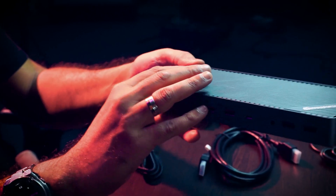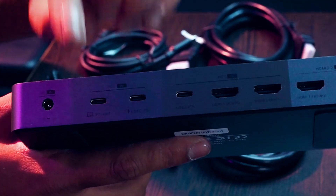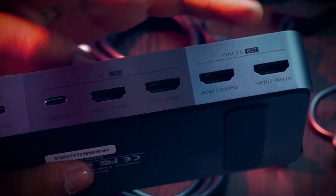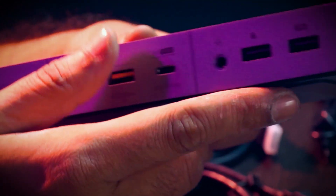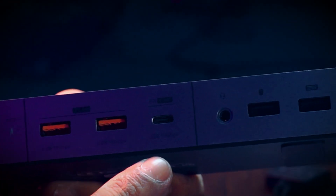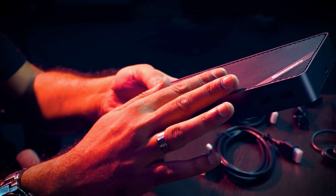The finish and build quality is superb. Now let's check out the input/output ports on the back side. From left we have: power in, host port USB-C, a fast-transfer USB-C with charging capability, then PC2's HDMI input one and two. At the far right we have HDMI output one and two. On the side we have a Kensington lock to keep it protected — you know, bad neighbors, gamer kids. On the front side from right, we have two USB-A ports for keyboard and mouse — for boring people — and MIDI controllers for us. Then we have a 3.5mm headphone port and more high data-transfer USB-C and A ports.